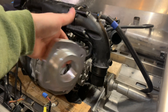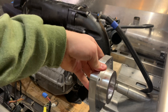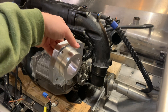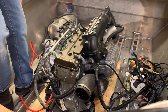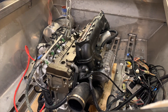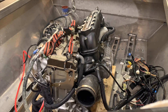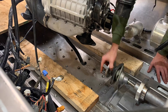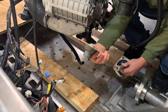Now that the pump is installed, I just have to pull the engine out so that I can slide the pump shaft forward so that I can put the collar on the intake. Once it's on there, I can weld it and then start working on the engine alignment.